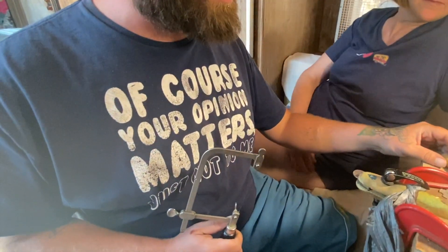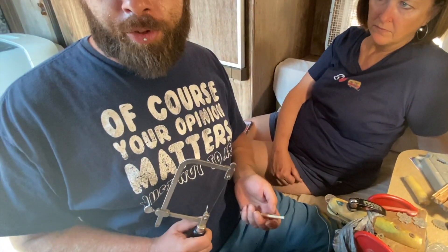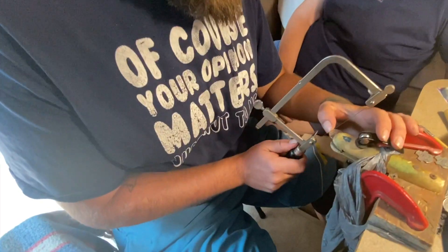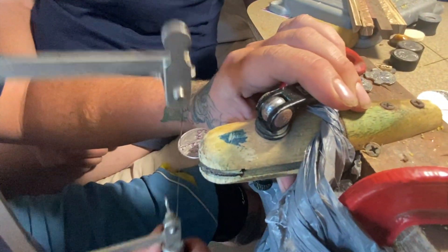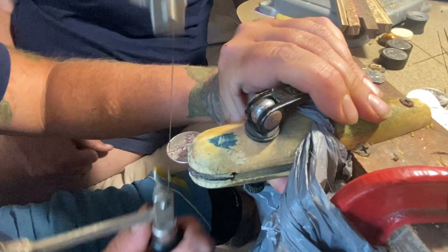Try to keep a dead finger — it looks like that now after the mouse chewed on it. This is a beeswax candle; it helps with lubricating the blade because when you're making those sharp turns you definitely want that fine little blade. A little brush, because once the wax gets on there the metal debris doesn't want to just blow off the coin. I like to line it up along my finger for the first entry, and then once you get in a little ways, that's when you want to wax.